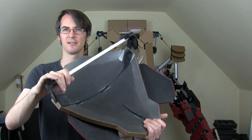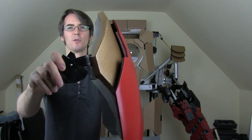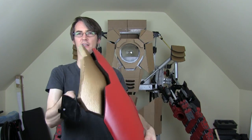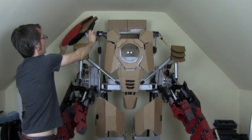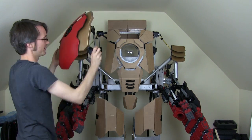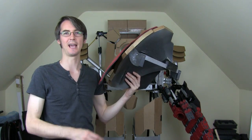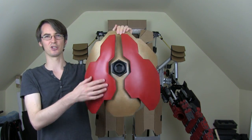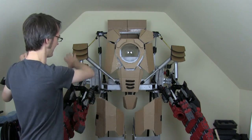My bracket is now mounted in here — this thing can rotate and it's just attached to one screw on the end at the pivot point, and once I've decided what that angle is I can put another screw in to hold it. So that's the existing mounting — this thing can have its pitch set, and then I can decide how I want it to be sloped when I've sorted out the rest of the bicep. There's a big piece to come on here which is going to be the pivot that covers this bracket, which is the piece I'll make next. In terms of visual impact I really want the rest of the suit to have this sort of level of detail with layered sections, and there are probably still some more detail parts to be 3D printed.